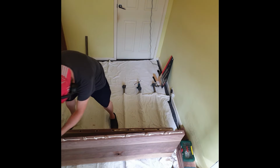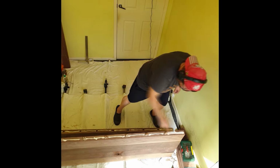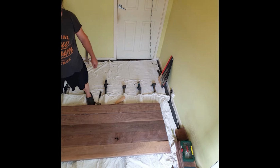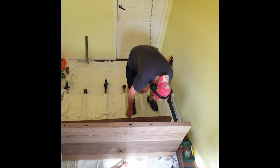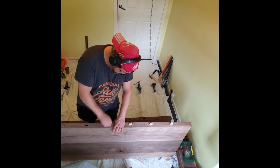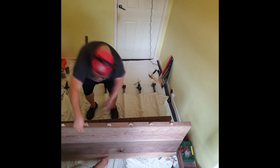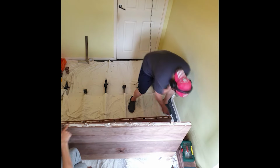So with regards to the clamps, the heavy duty clamps, guys, I highly recommend you not to spare any money when it comes to them. Don't get the low quality ones that bend, because you will affect your work a lot, especially on heavy duty. As you may see, I use 6 planks, so you need quite a force to have them joined together. What I did for example in here, I have in total 8 clamps, but I used only 6 this time because they are plentiful and the spread of force is even, and the table came out perfect.